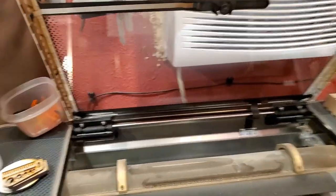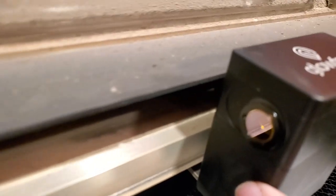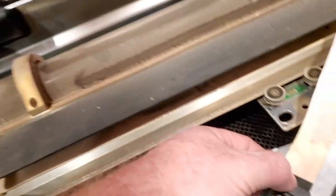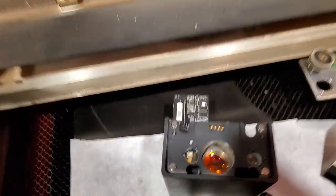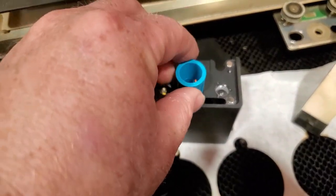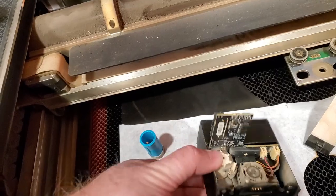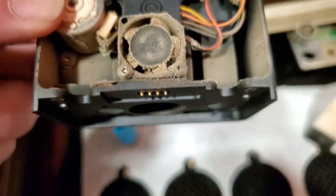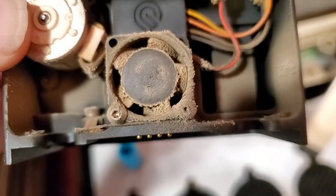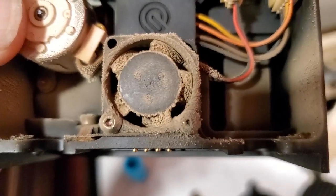Your normal routine: make sure the lid camera is clean, make sure the side window is clean, and there's one right over here — make sure that one is clean too. Pop your laser head off; it's best to remove the snaps on the cable as well. Clean the two little side windows, and use your tool to take out the lens and clean both sides. Also make sure your contacts are clean. And you can see how nasty the air assist fan is — that is usually the number one cause of the 'cooling down' error. I used to get that all the time, and it stopped when I started cleaning that fan once every month or two.